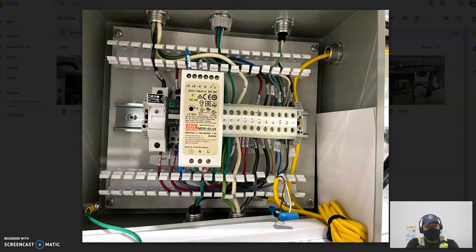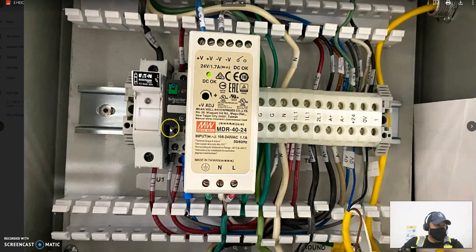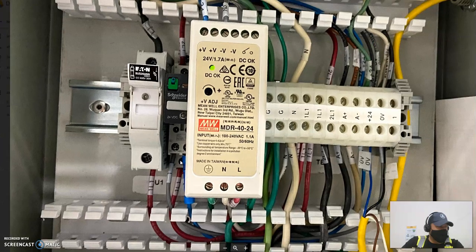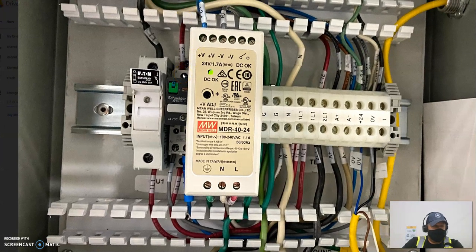To talk about some specific examples of troubleshooting, we'll use some SEV-2 events we've had recently. In one SEV-2 event, they lost power — plug was good, breaker was good. I opened the control box and the first thing I saw was this relay; the green light was lit. That green light gets lit when one of your start-stop switches is activated and turned to the stop position. I verified I had 120 at multiple points up to the relay, but right here and here — no 120.